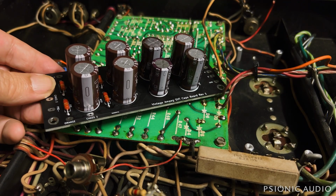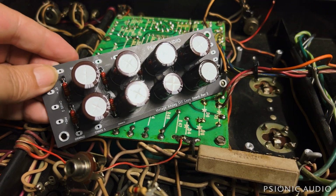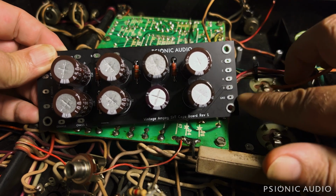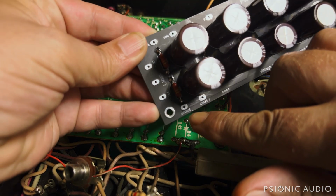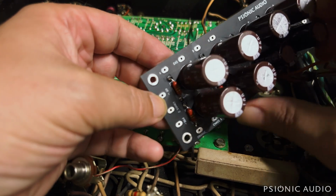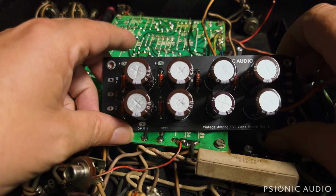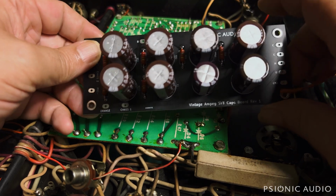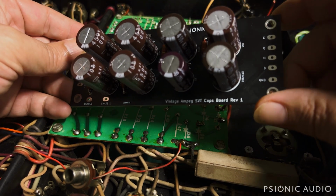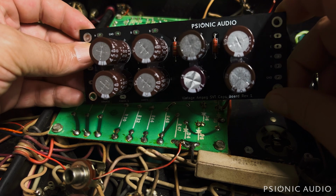And you can see a little bit of the isopropyl still on the board there from when I cleaned off the little bits of flux from the solder joints. That'll evaporate all the way up. You can see I've got the nodes named here: CEHD ground, ground 1, orange, pre-negative, chassis 2, that's chassis 1, chassis 2 over here, output negative, A, ground, B, B. All those connections go to the places marked on the schematic of this area of the SVT, which have the same net names, and all the resistors and capacitors have the same names as the old ones, so it's pretty easy to navigate. I may make these available to other techs at some point once I make sure it's working to my standards.